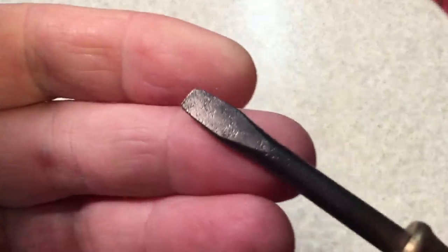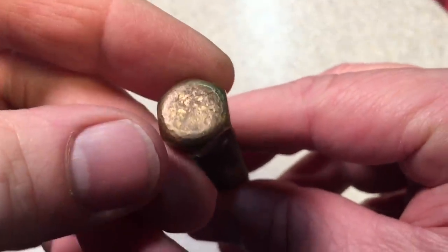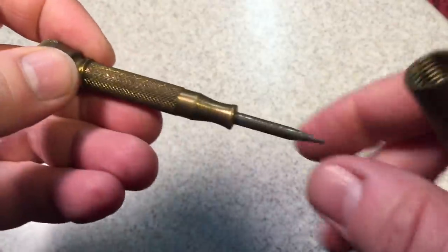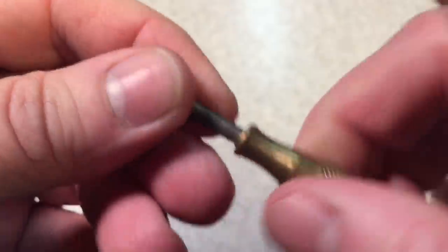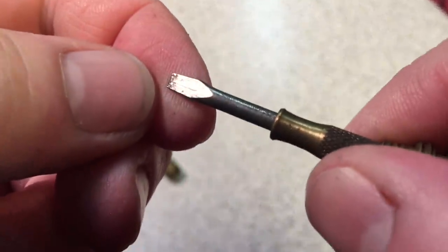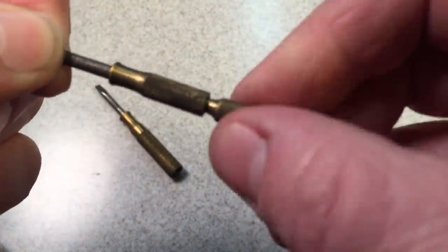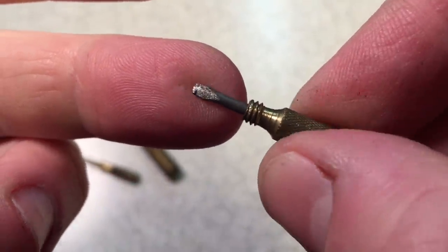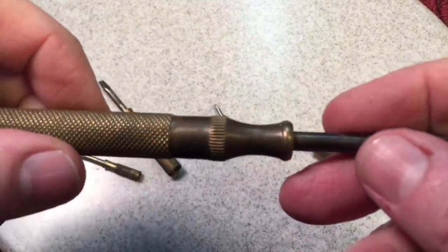But a couple of issues we have to address. You see the pitting? We have some pitting on there — we're going to have to remove it. See the back of the cap here — it has some dents in it. Otherwise it's just patina, standard patina, and the rest of the blades are pretty decent. We've got pitting on each one, so they all have to be ground down and cleaned up. This blade here — again, a little bit of pitting. The only blade that has damage is the real small one here. See that it's curved over? That's the only one we're going to have to repair. Other than that, we just got to do a quick cleanup — let's get to it.